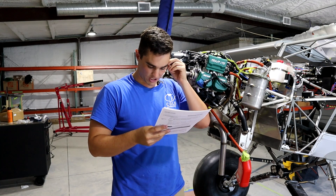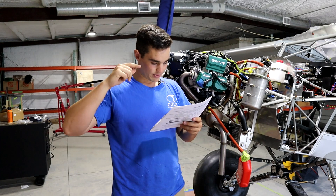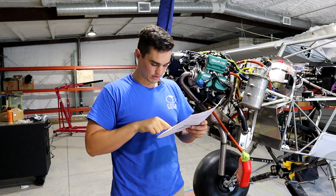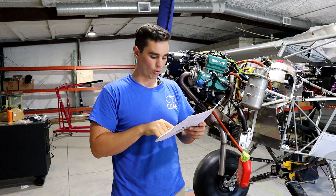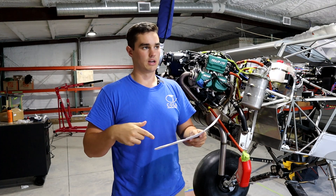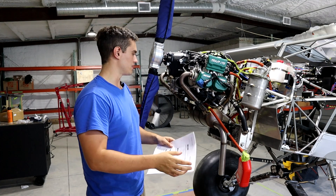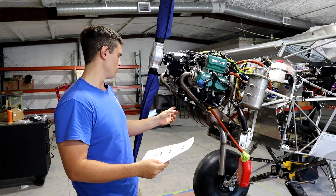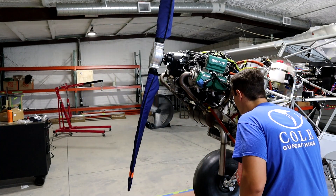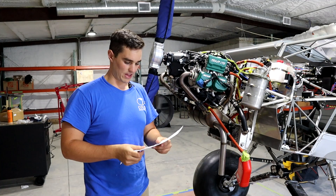It says it's going to take 20 turns, and depending on installation it might take up to 60 turns. What we're doing is turning the engine until the first pressure indication on the oil pressure gauge of engine instrumentation in the cockpit. I turn the engine, he watches the gauges and tells me when the pressure comes up for the first time - that basically means oil has made it through the pump and to the pressure sensor.